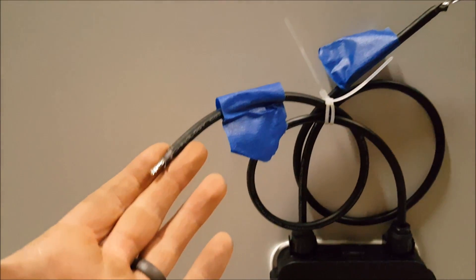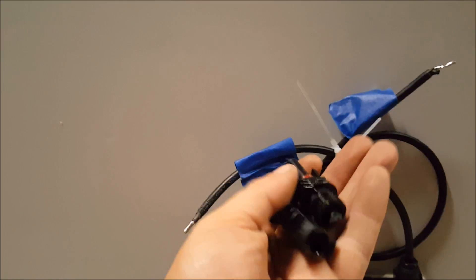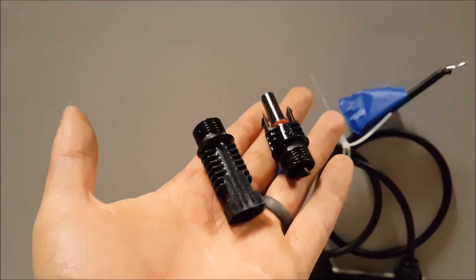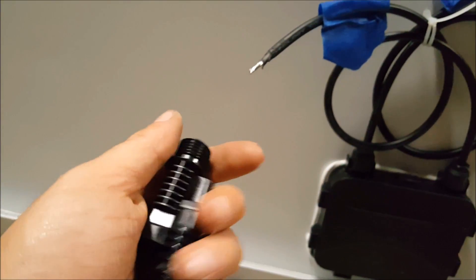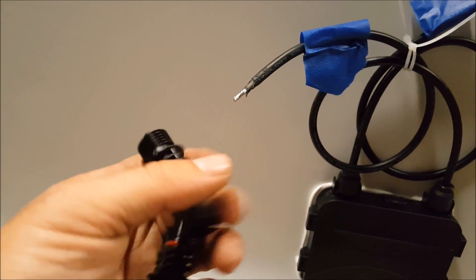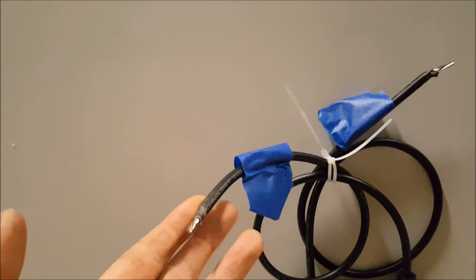I'm going to show you a little trick with my 150-watt Renogy solar panel. This is the back — it's upside down. From videos I watched, people said these came with labeled connectors. I cut those connectors off because I don't need them — that's just for easy connecting, but if you cut them off and strip the wire, it's one less connection and less resistance. Mine did not come labeled — there was nothing on the wires showing positive and negative.